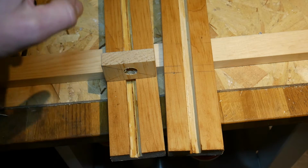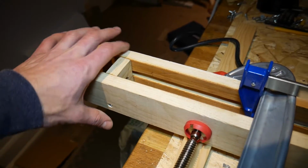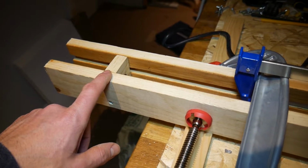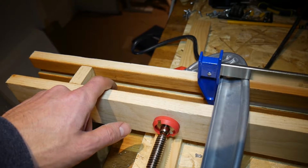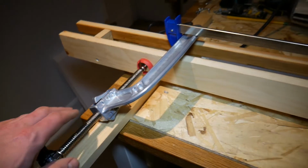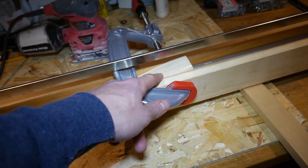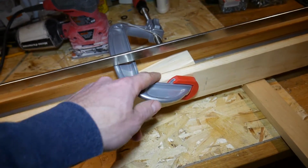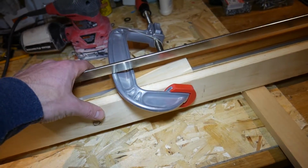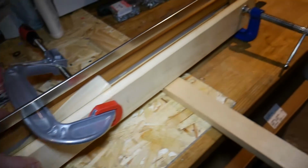So let's go ahead and do that, and I'll show you what's going on at the top end of these pieces of wood. And so after putting our 2 wood screws in on either side, you can see that the small piece here is secured in place with the screws and the wood glue. Our stained faces are facing inside towards one another. And I have a number of clamps here, and we're gonna get to those in a second, holding this piece together. And in the middle, there is another clamp with a 1.5 inch wide offcut. So this offcut is just sitting there. It's not screwed in any sort of way. It's just keeping these 2 pieces of wood from bowing while they're being clamped together. So it provides some rigidity to this piece in the meantime.